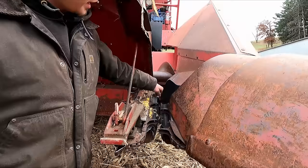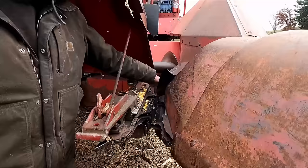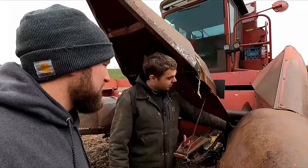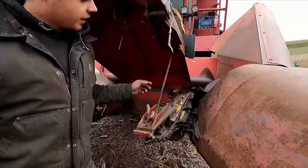If you've seen in the last video, this row was giving me issues. The wider you go, the more material you can get through the area, but the wider you go, the more chance you've got at shelling. Yeah, and header loss, which you don't want. It's a happy medium.